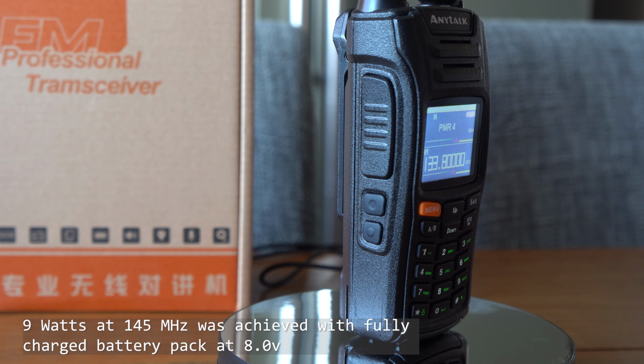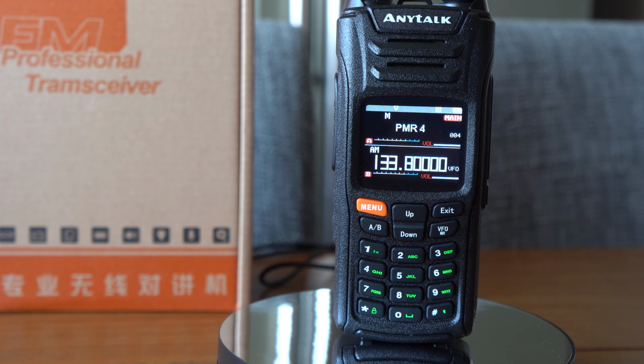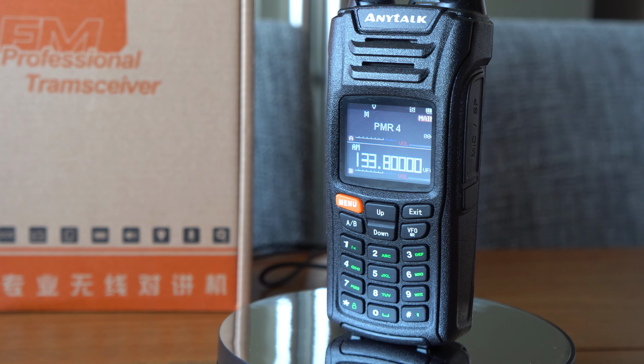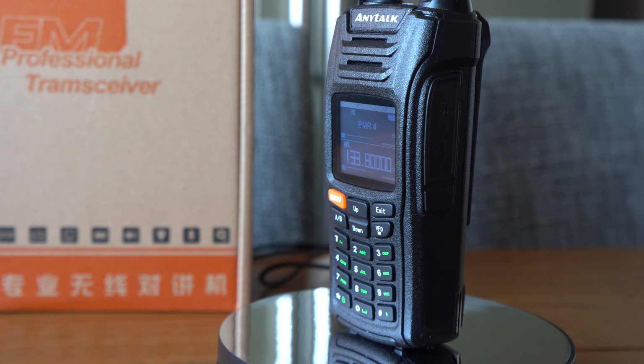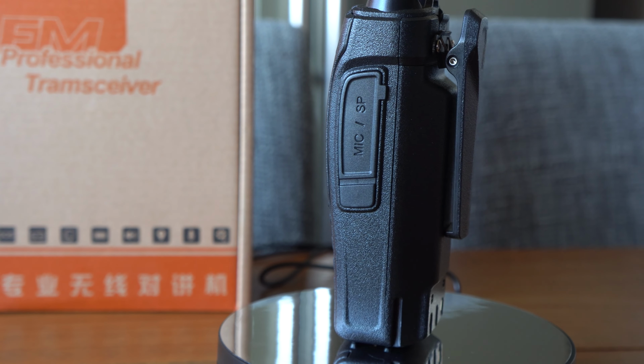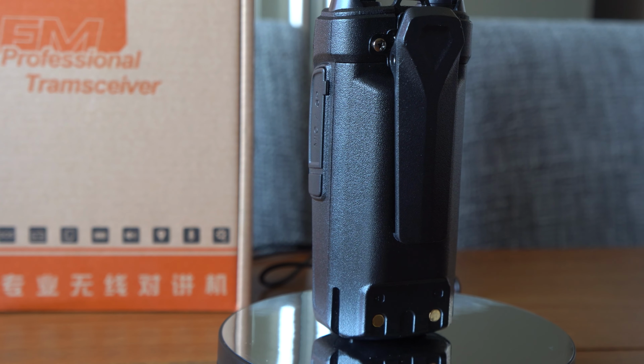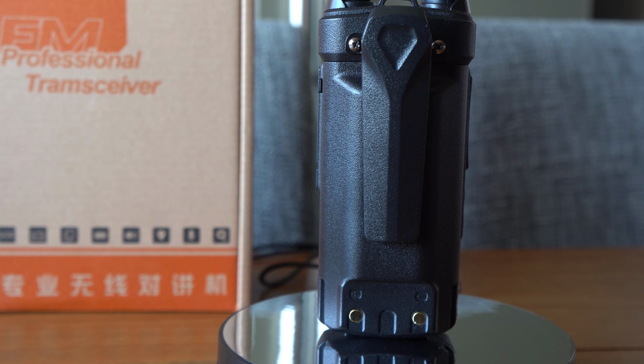I've taken this radio out and about for the past few weeks, testing it mainly on PMR446 frequencies and around the 2 m amateur radio band. Please remember that technically the radio is not approved for use on the 446 band, as its power level is way above the 0.5 watts that is currently allowed in the UK and Europe. I've made some interesting contacts over some impressive distances.